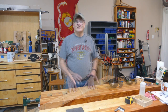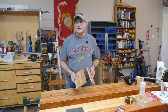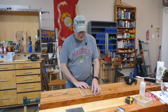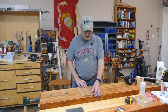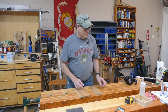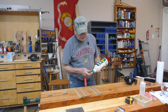Now let's start making. This project requires an 8x10 platform. What I've done here is cut two pieces out of fence pickets — the total dimension is 8 inches across, 10 inches long, actually a little more because I've left a little extra to be able to trim off. Now I have to glue these up, so I'm going to use some Titebond 3, which is waterproof glue.